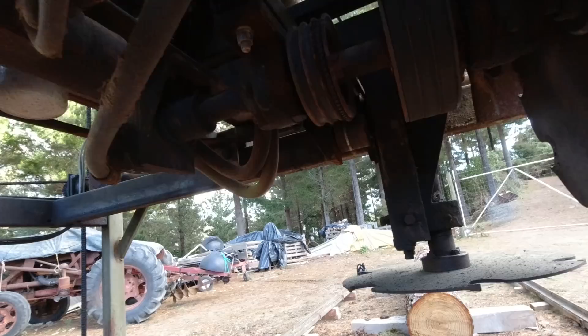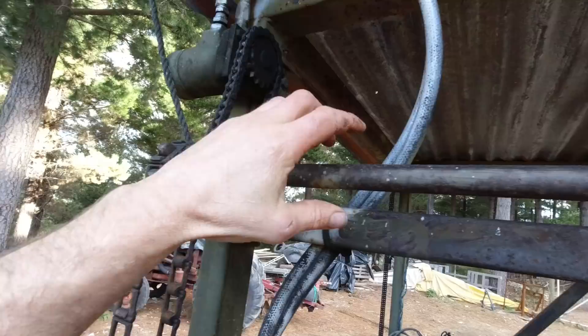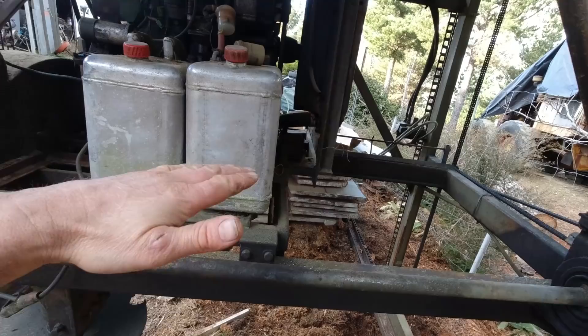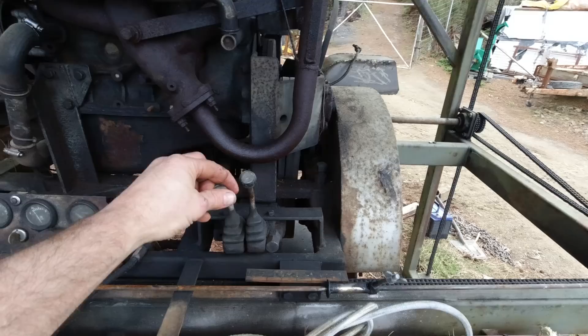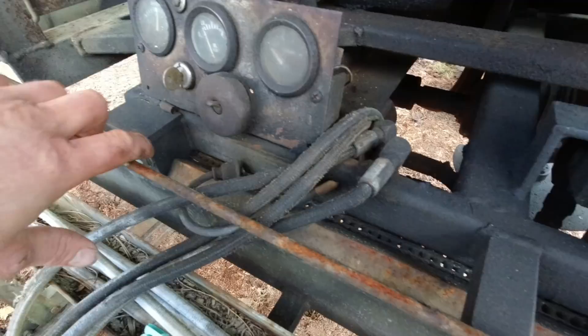At the end of the shaft there's a little hydraulic pump. There's one hydraulic motor to run it along the rails — this one here drives the shaft which runs the chains and that pulls itself along the rails. There's another hydraulic motor here which raises and lowers the mill, and one more hydraulic motor which controls the side to side movement. So it's all hydraulically driven along the rails and adjusting the cut.